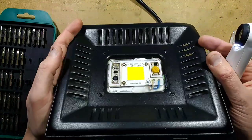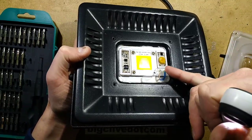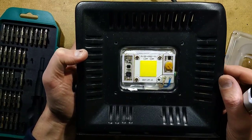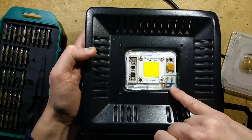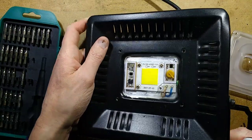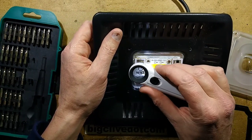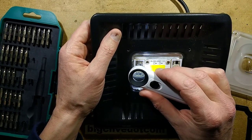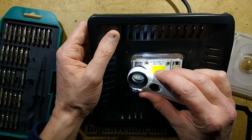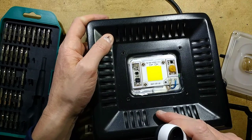I'm quite perplexed by the way the cables are routed. They've sat this onto a piece of aluminium and the cables come right up the back and fold over — that doesn't look like a very good design. The earth wire comes over to the side and is screwed onto that position. It really does look like it's crushing the cable. It looks like an SM-style chip that switches the LEDs in sections.